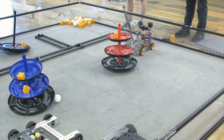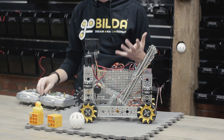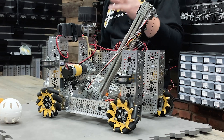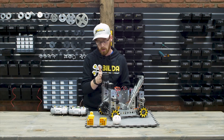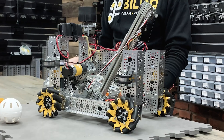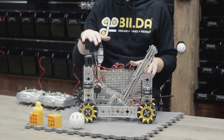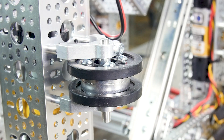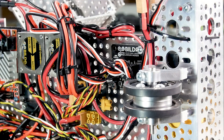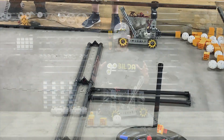The next thing I want to talk about is our carousel mechanism — another crazy simple idea that works pretty well. It is a super speed servo in continuous rotation mode with two 72-millimeter geckos bolted to the top. You drive up into contact with the carousel and run the super speed servo. Very simple, but reliable and effective. The last thing to touch on are these rollers: 48-millimeter disc wheels suspended by 6mm ID bearings. They protrude past the side of our mecanum wheels and allow us to quickly graze alongside the field wall very easily.